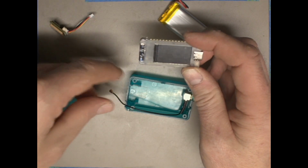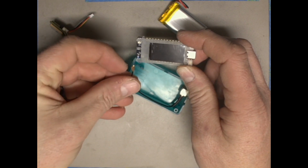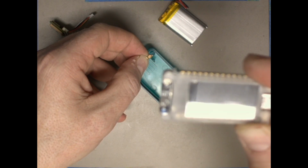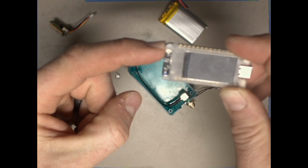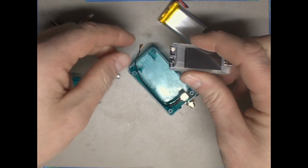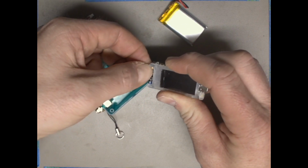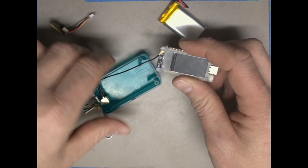microcontroller board, and we've got this IPEX connector off of our SMA antenna pigtail. We're going to put it right here. If you look, I'll let this camera focus a bit. If you look right here, you can see there's the IPEX connector on the microcontroller board. And we'll just take this and put it on top, and it'll click in like a button. You'll hear it and feel it just click right on there. And then you'll be able to rotate it but it'll stay connected.